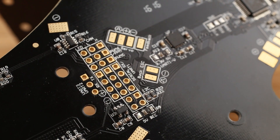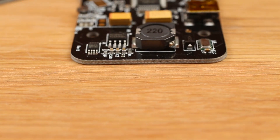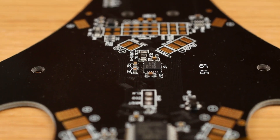Perfectly in the center of the frame we find an MPU6000. This gyro and accelerometer chip is the least sensitive to vibrations out of the whole family. It's connected through SPI, which means it's eight times faster than an I2C connected gyro.